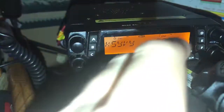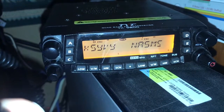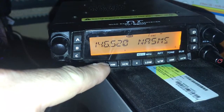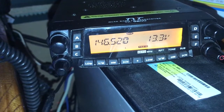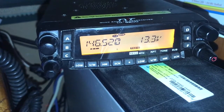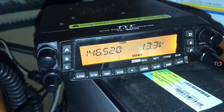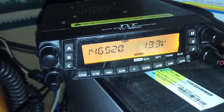Here's one of my local repeaters — I go to key up and nothing. That should have come back almost full scale. It's transmitting outside of the amateur band. Going to 146.52, it does not transmit on 146.52 — I'll key up and you'll see there's no offset or split showing. This radio is receiving 137.82. You don't want to be transmitting your call sign thinking you're on national simplex when it's actually transmitting close to the air band at 137.82. So there may be a clue right there.